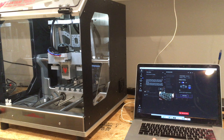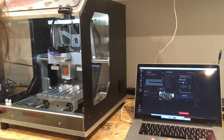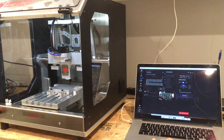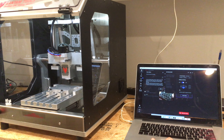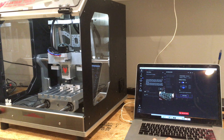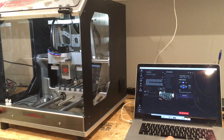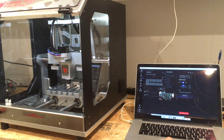In the jogging window, hitting install tool — it does move quicker now. The motion sounds a lot like GRBL to me; we'll see if it's running GRBL underneath. That appears to be the tool install position. Moving Z down — that's a really slow acceleration profile. Interestingly, it prevents you from crashing Z, which is good. But we crashed Y — we've actually run out of distance.